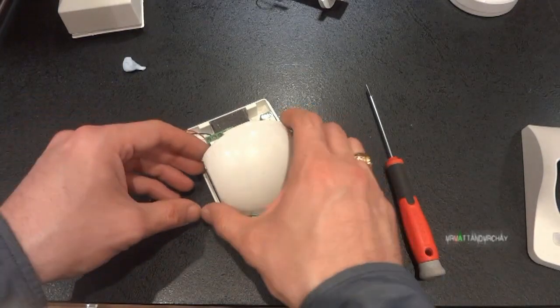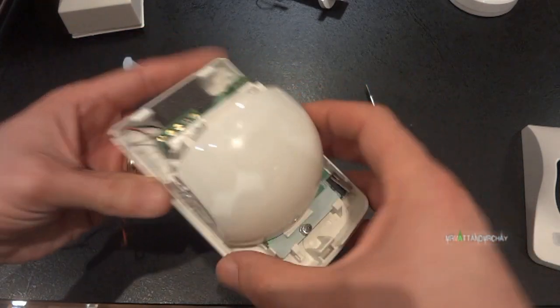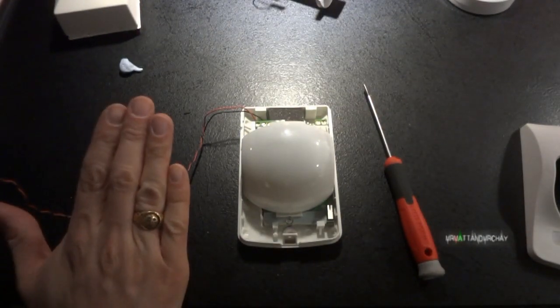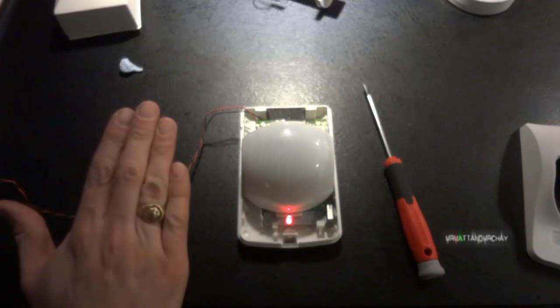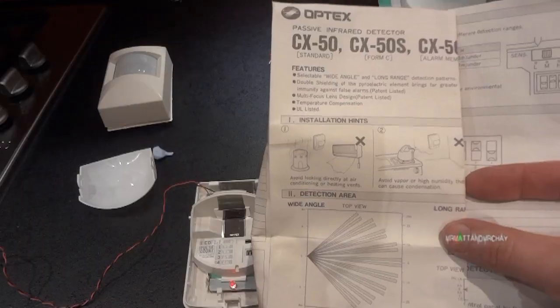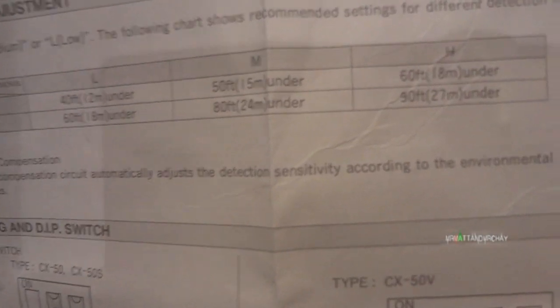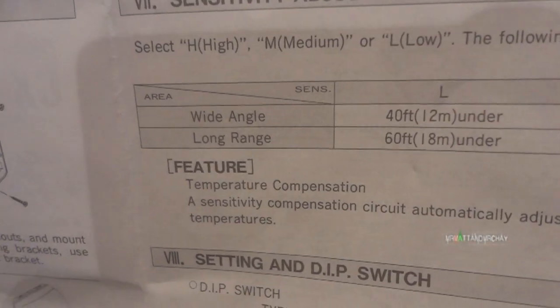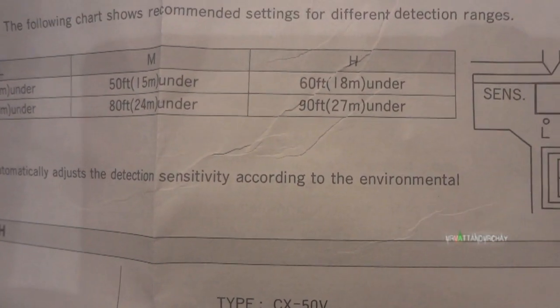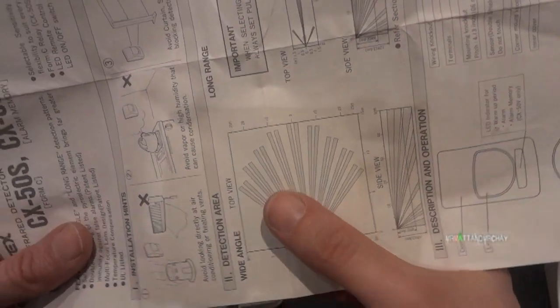Let's test out the multi-zone capabilities - that's the type of lens we've got on the top part now. So I'm now beside the PIR, and if I bring my hand up, it's going to detect me at this angle. That is the 90-degree corner mounting lens that's currently selected, and that will detect a standard room. Looking at the instruction manual: this has a range in the wide angle of 18 meters, but if you change the lens around and make it long-range, you get nearly 30 meters.